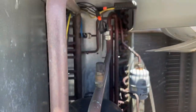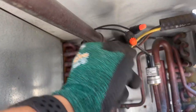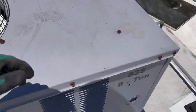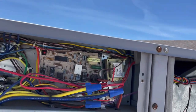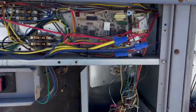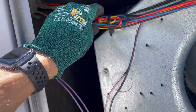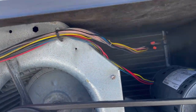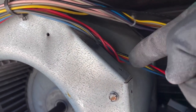When you see stuff like this — that is stuff that shorts to ground. Now these are most likely off of 24 volts, so if for some reason your fuse on your transformer is tripped, it would blow that and kill your 24 volts going down to your thermostat. I don't smell anything burnt up here. Oh, I can see it right here. This is an easy fix, everybody. See that little dark mark and that nice sharp edge? That's why I wear gloves — sharp edge. There you go. See that shininess right there? Short to ground.